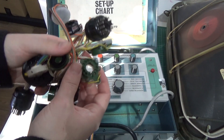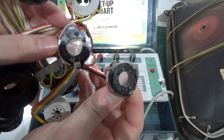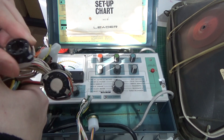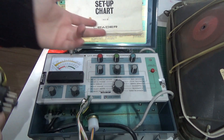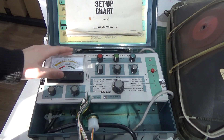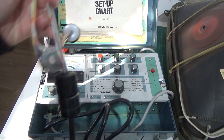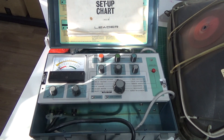There are some that might be useful — for example, I believe one of these is a monochrome, black and white socket. Of course this can do black and white as well, and the cool thing about that is I wouldn't actually use it for a black and white CRT — I'd use it for a monochrome CRT, like a green or an amber display for a vintage computer. That's a really good use case for the black and white side of this rejuvenation tester. Anyway, I need to make my own custom adapter, which is what a lot of people do when they get these kits — they make their own adapter to fit the more modern CRTs.